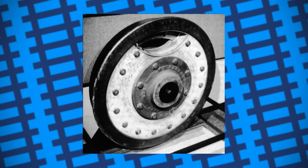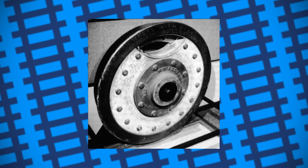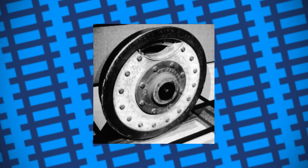He glued together circular sheets of paper in layers and compressed them with a 650 ton press for 3 hours, then letting them dry out for several weeks. Afterwards, the wheels were machined on a lathe, had several holes drilled through them and sandwiched between two iron plates, both bolted in place — one ring to secure the tyre and the other to secure the hub that connected the wheel to the axle.